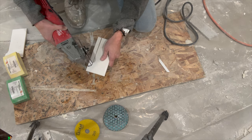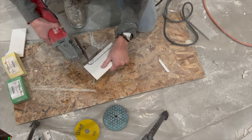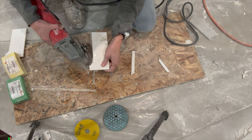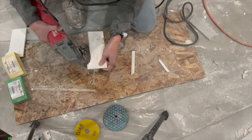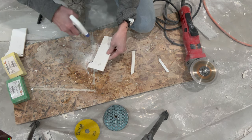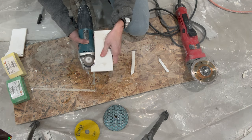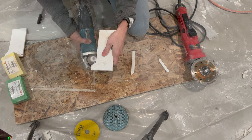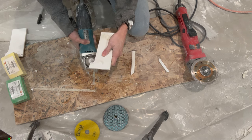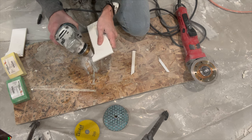Just make sure you undercut — don't overcut. Obviously, if you take too much off, you can't go back. But the point is we're undercutting here because we're going to use our little secret weapon to smooth everything out on this curved section. I'm specifically showing you guys how ugly this cut looks right now — it does not have to be perfect with your initial cut, because we are going to use this cone. This attaches to your grinder and it's a diamond cone, and you can use it to smooth curves and circles. It's a super handy tool — you can also get this on Amazon, I'll put a link below.